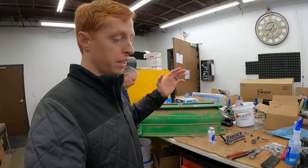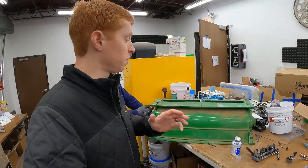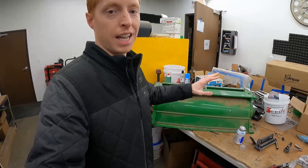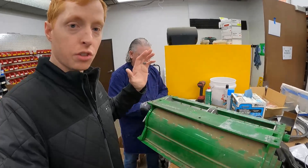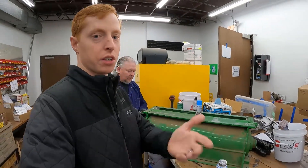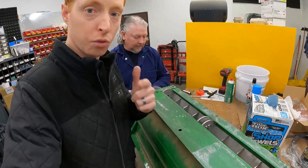We got it on another cart. What we did is we value-engineered it and got some of the cost out by putting a John Deere OEM meter housing in good condition back on the seed tank — and it's going to have the stainless steel half-width disconnects. I would not put a John Deere meter housing back on anything without doing that as a minimum. So we've done that, and that means it's going to function really well whether it's seed or fertilizer. He's going to use it for seed so it should last a long time. If he used it for fertilizer, it would corrode and have problems over time, but it would never have half-width disconnect issues where these things twist and seize anymore. That's really important.